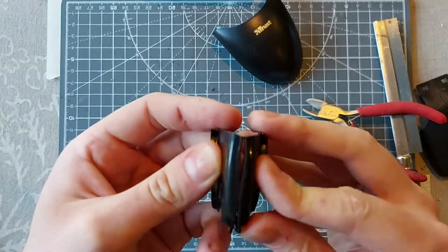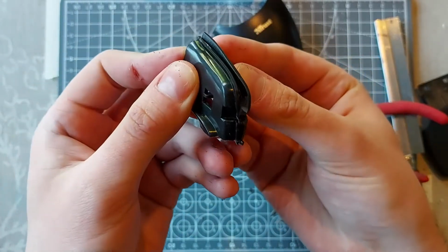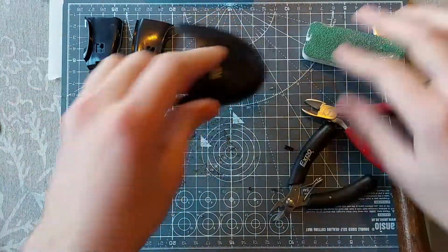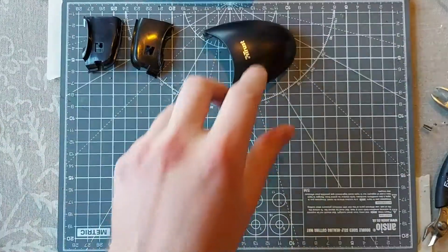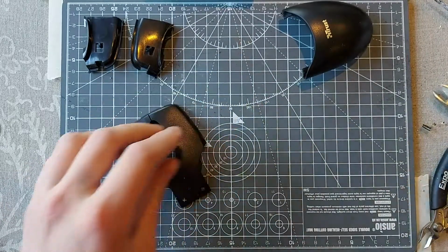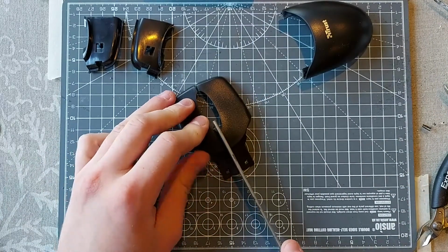You see also that I'm aligning the two pieces. I'm practicing putting them both together. Anything like this, half of it's muscle memory. This is what we call a dry fit. You want to put the pieces together without glue to make sure that everything fits together. And when it comes to gluing, you'll actually be able to position them much more effectively.